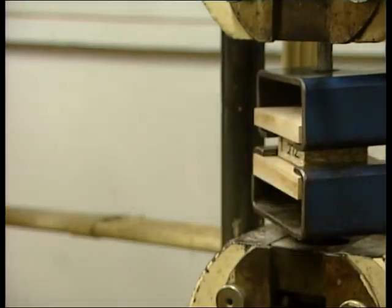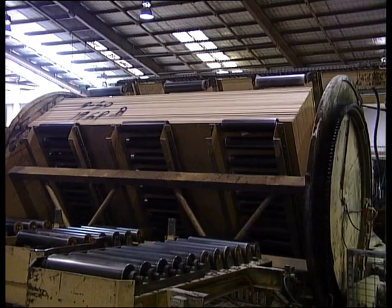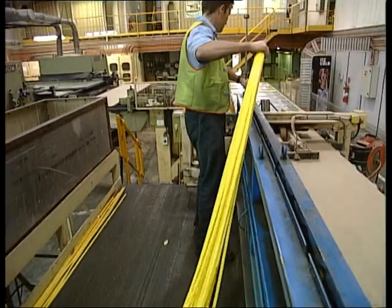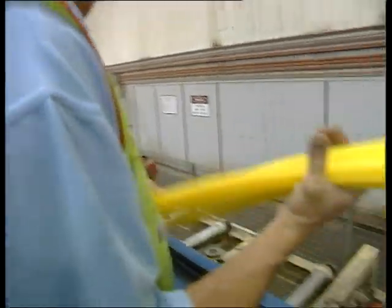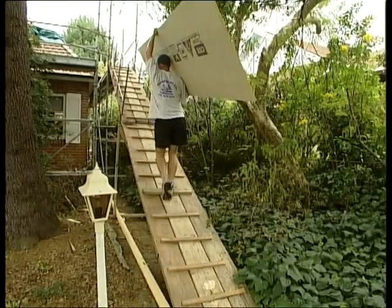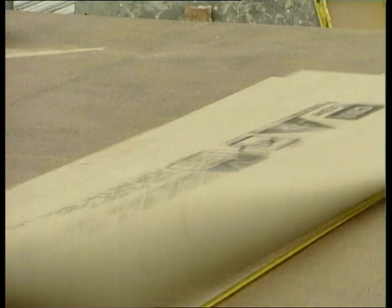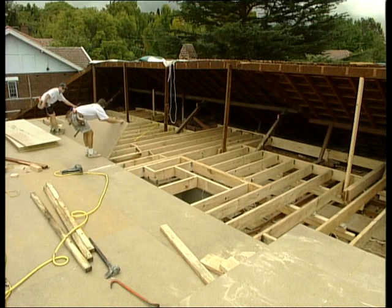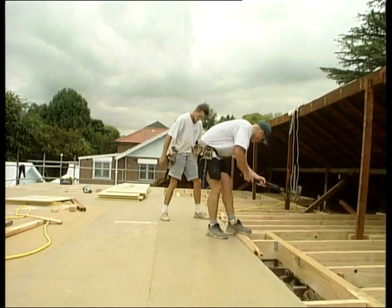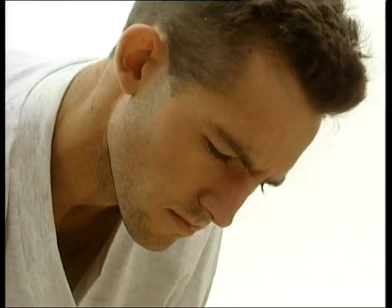Every hour, the strength of the glue is tested. The boards destined for floors are usually more water-resistant. They are grooved and a tongue put in position. The joints are machine-joined, so when they come out from the factory, they're very straight. When laying your floor, it's best to make sure you keep those machine-joined edges together. If you're cutting a sheet, don't put the cut side against the machine-joined edge, so you get a nice join.